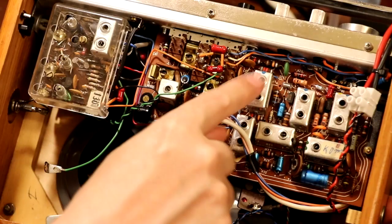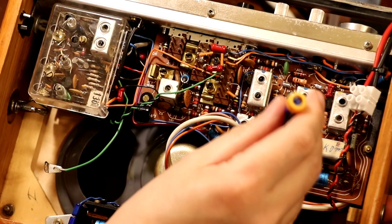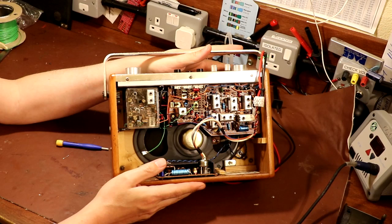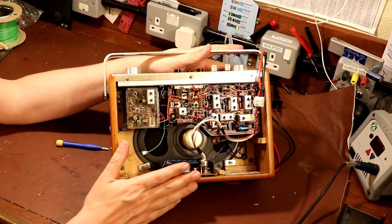So it's quite common to have to take a small screwdriver. Now, I'm not going to adjust it, but you can put a screwdriver into some of these things, and you can turn them, and we can adjust. There's a ferrite core inside here, and we adjust them to get the peak performance out of the radio. Now, when we do a radio alignment, we need a signal to actually align the radio to, so it's quite common to connect a signal generator to a radio like this.